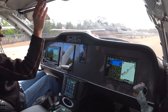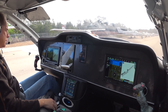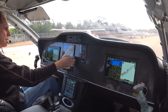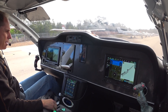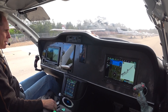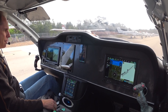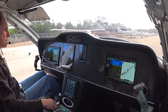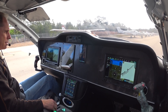That was pretty successful. We can turn this off now. So that was interesting — I only got the fuel low warning come on and didn't get the fuel empty one, so that's good. I got to 245 on the temps and the EGT was 1750, then I backed it off. It goes down real quick when you back off, and I was backing off from about 44 psi down to about 40 psi.